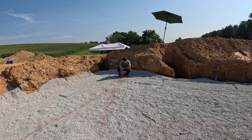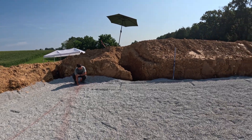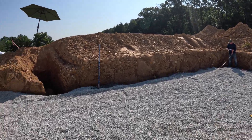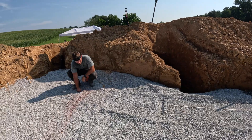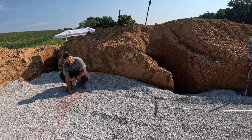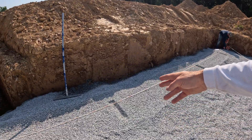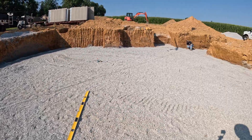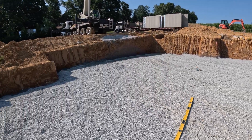These guys are working overtime and it's getting hotter — better get plenty of water for them. Laying it out the way it needs to be, we got all the sections marked. They're measuring out the distance right now, and once they get these pins straight they'll snap the line and the outside face of the wall will sit right on that line. Each wall is a section; this is where they're going to meet, basically right to that line all around. They're checking for how square it is, and once they get all that they'll be ready to go.